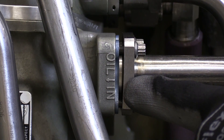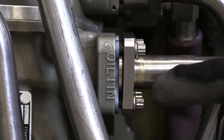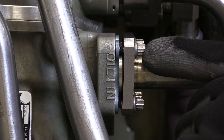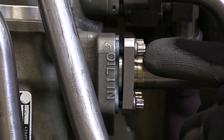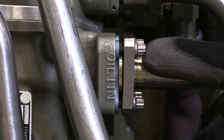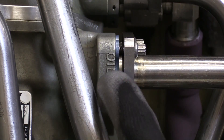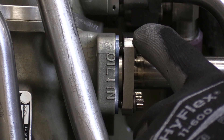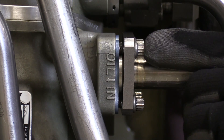I want to illustrate another hazard to pay attention for. I have these four bolts installed on this oil-in line — I've run them all the way down, and as you notice, this thing is not seated. If I were to run it down any further, I am at risk of exceeding the aircraft maintenance manual torque value and also damaging the inserts inside of the LRU accessory. So I'll go ahead and loosen these up, reposition the manifold, run the bolts down, and torque.